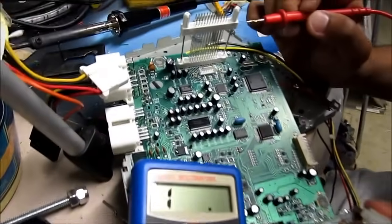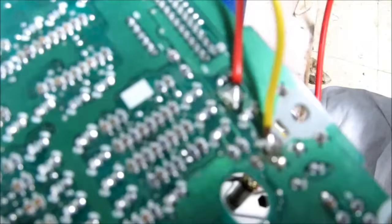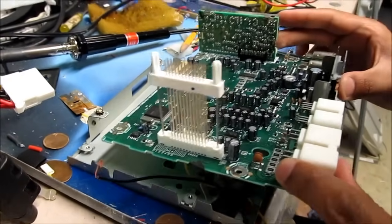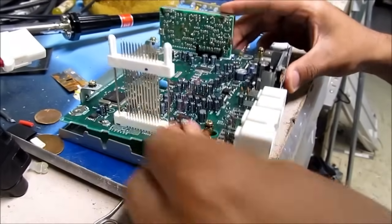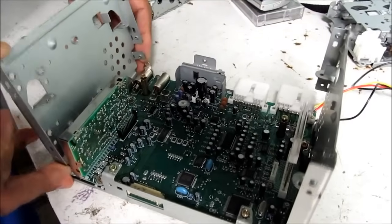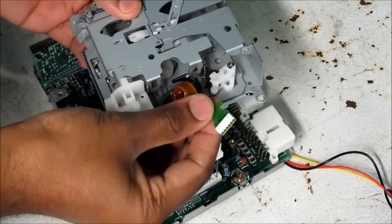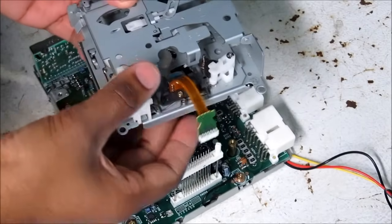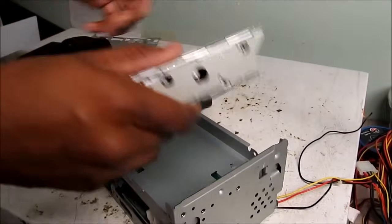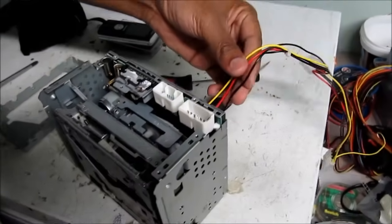Test the solder connections by connecting to a multimeter. These are the solder connections on the back of the radio — the left and the right. I'm going to close up the main board now, screw in the ground wire, and install the tape deck. I'm going to make sure to leave this disconnected so that it doesn't cause any hissing sound when I'm playing by auxiliary input. I'm going to connect this guy up here. So at the back, I ran these wires for the auxiliary cable.